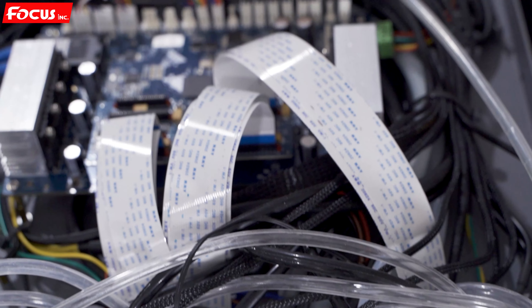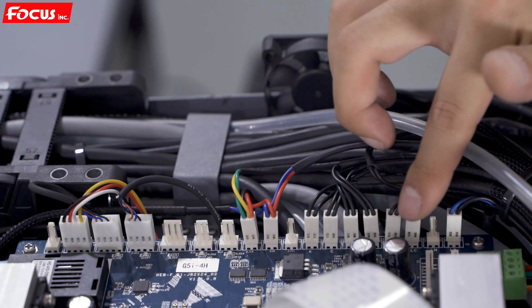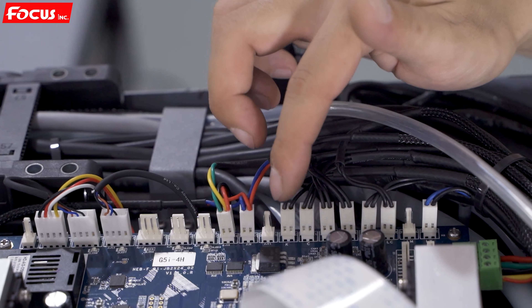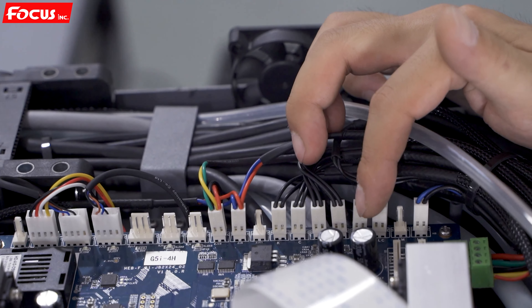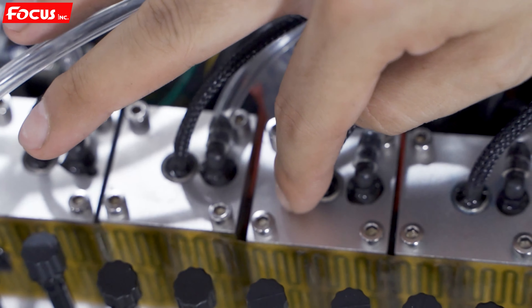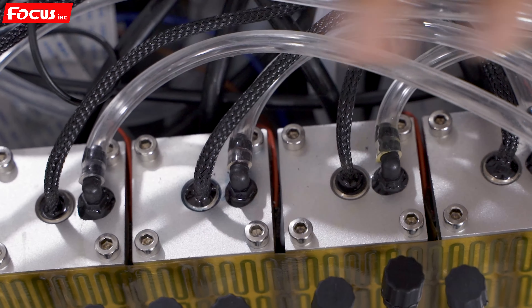This plug is for the front air tank ink level sensor. Here is the ink level sensor for the front ink tank — not the air tank, but the ink tank — for black, cyan, magenta, yellow, white, and varnish, one for each. Once the ink level sensor detects that the ink tank is low on ink, the board will start pumping ink to refill from the bottle to the sub-ink tank to maintain stable printing.